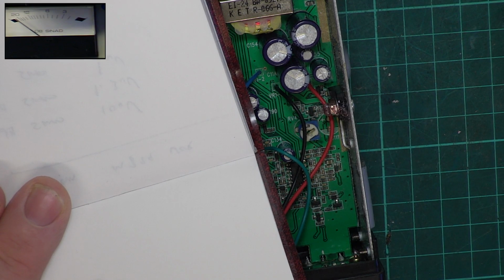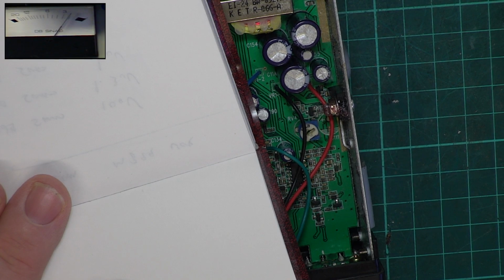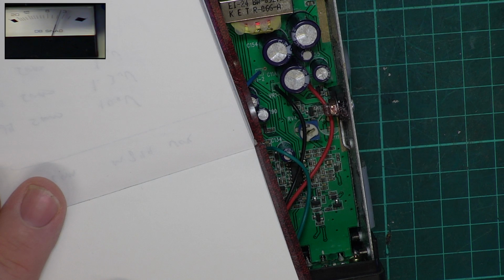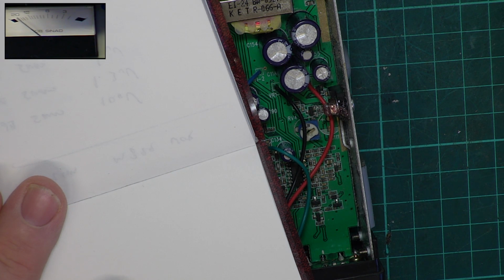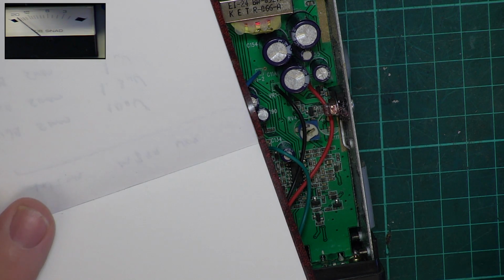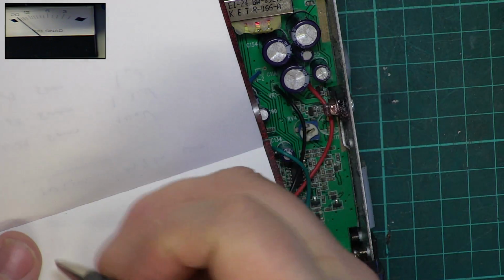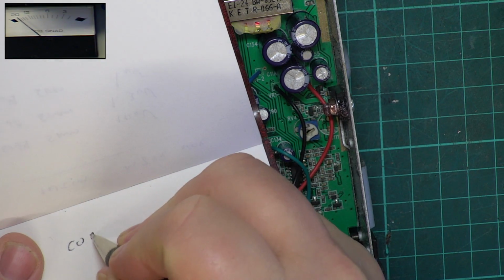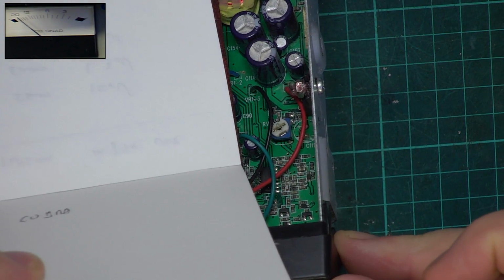For a start, let's see what we can hear the radio going down to. We can hear it down to about 1.7 microvolts. So let's see how that relates. So for 20 dB SINAD, I better write this down. Cobra what? 19DX.